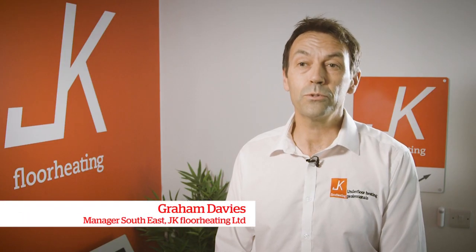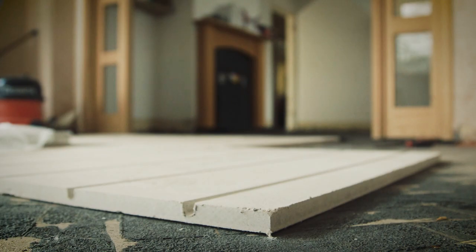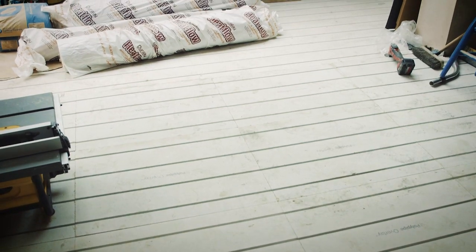Every house has got the potential to have underfloor heating, whether it's wet or electric. Some as an additional form of heating, bathrooms and kitchens with electric mat, for example. Some as a primary heat source. There's numerous retrofit underfloor heating solutions on the market, warm water-based or hydronic or electric systems. The warm water-based systems tend to use either routed chipboard or routed gypsum board.